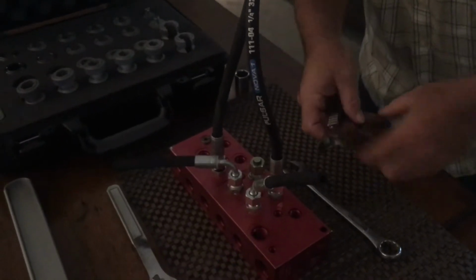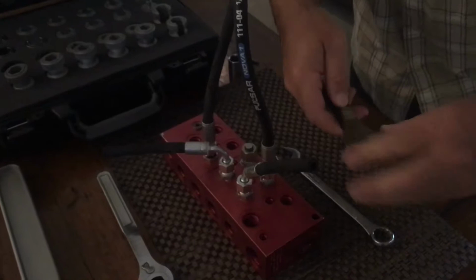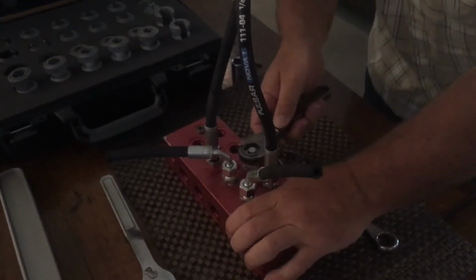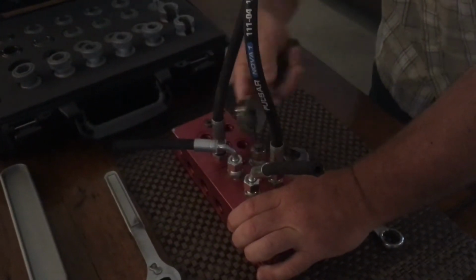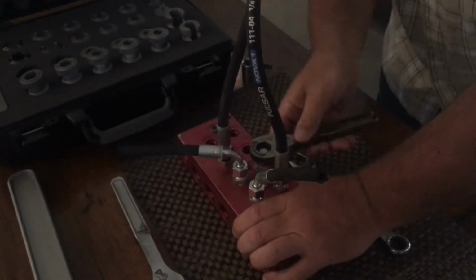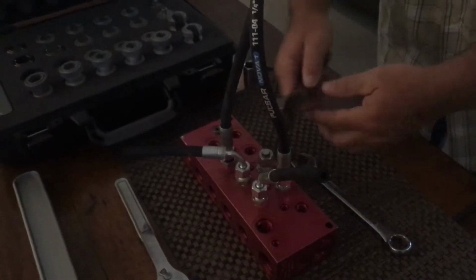With the RotechTools open-ended ratcheting wrench, you put your box end attachment in, engage one time, and spin a nut or a bolt off. To reverse, you would simply flip the tool over, engage one time, stay engaged, tighten it up.